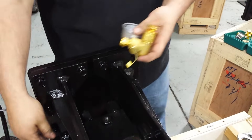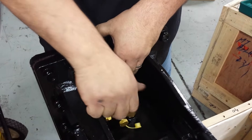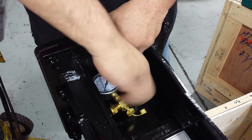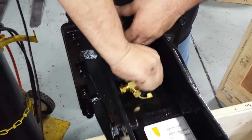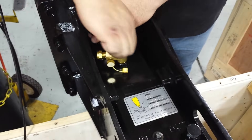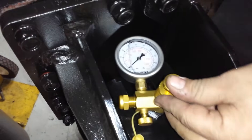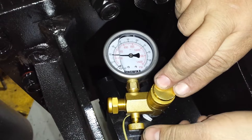With the cap tight, I'll install the charger one more time. On larger hammers you've got more room and don't have to remove the charger as many times — this one's a little tighter, but it's just as easy to take off. Holding it to one side, I snug it down and move the whole thing over. Check to make sure everything is tight. Now I'm going to get a reading again — and as you can see, I'm at 260.